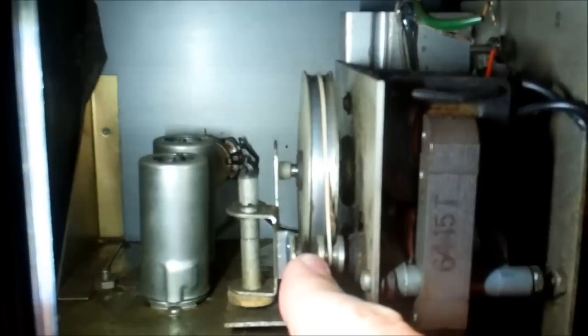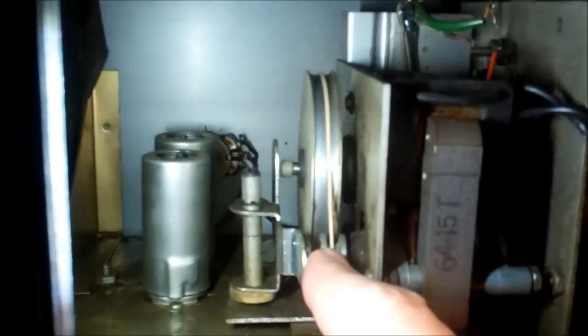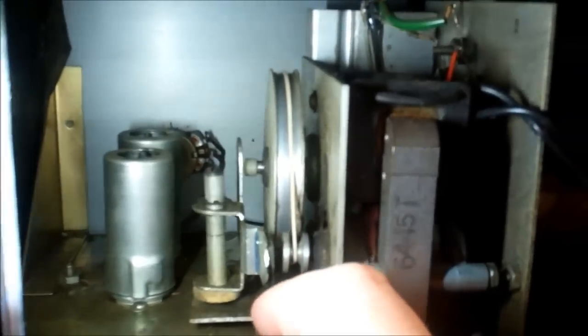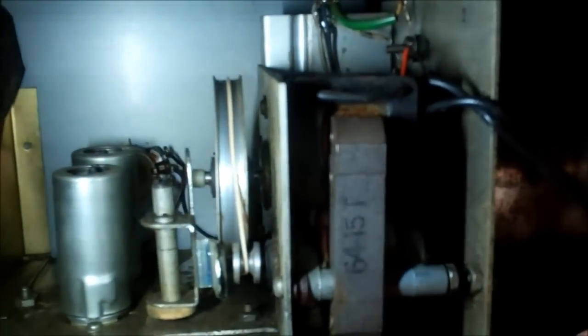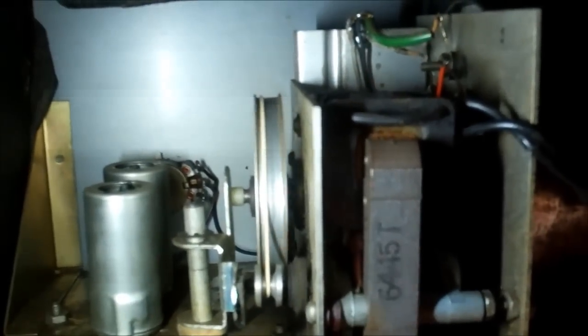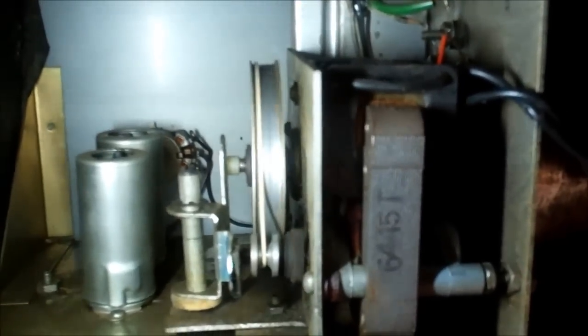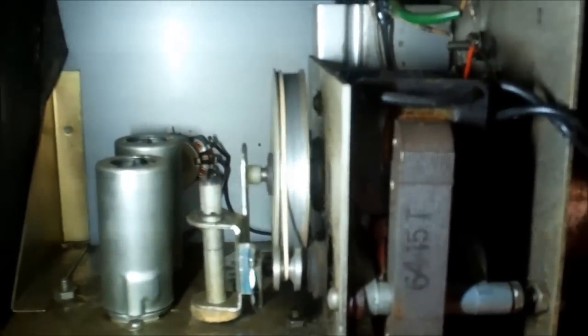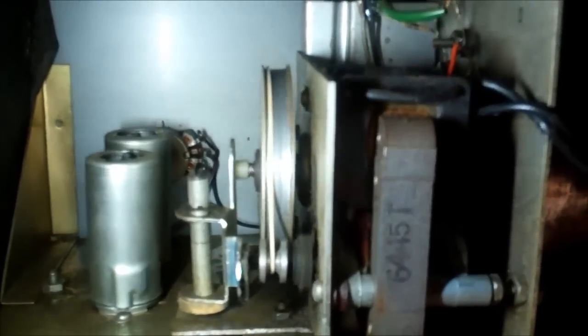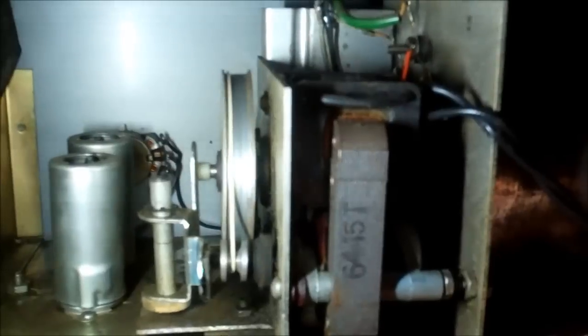Also, after the motor pushes the rubber wipers against the disc, it will begin to rotate, the disc will pick up oil, and the process begins. So let's try that just for fun. We have our motor disengaged and all of that. Flip the switch, and you can see the solenoid function of the motor coming out, engaging the rubber wipers, and the echo begins. This was actually the unit that I used to record our little opening.